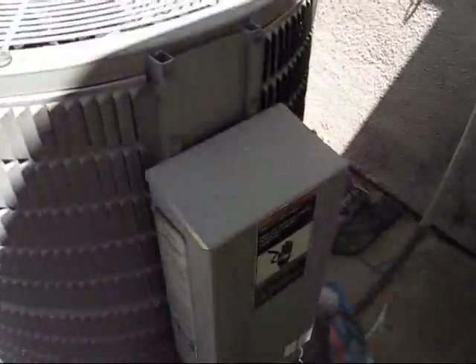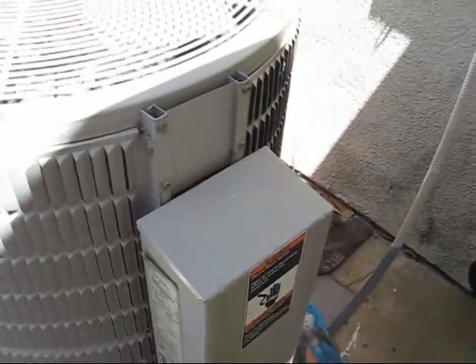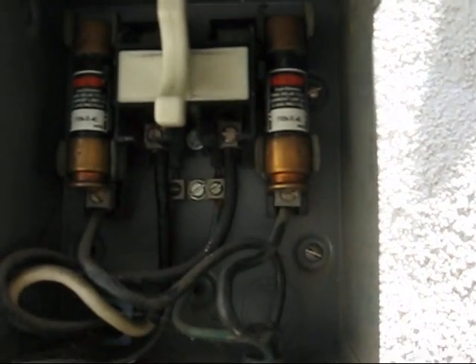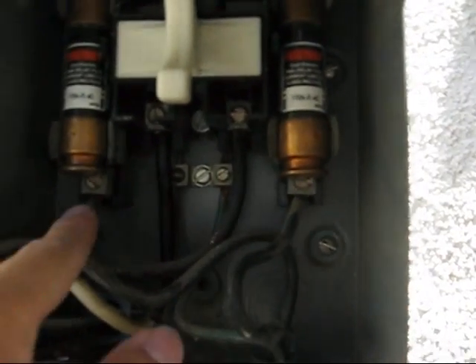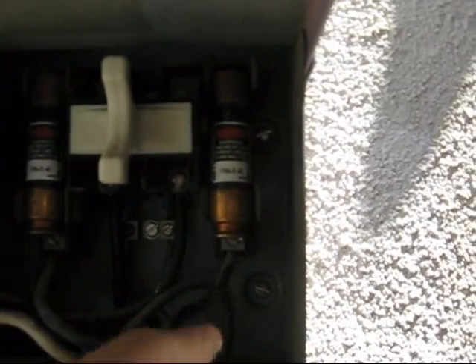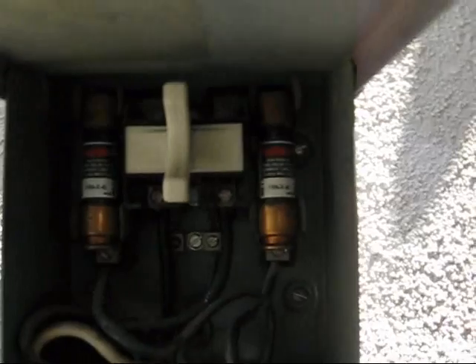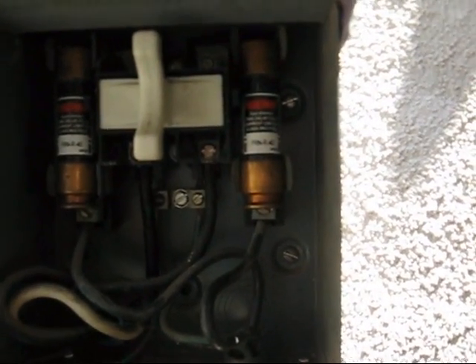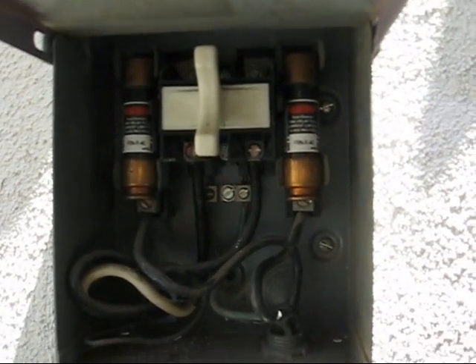So far this unit's worked pretty well. I had to replace the contactor once, and it's blown a couple of fuses. One thing I'd suggest: check those connections underneath the fuses to make sure they're not loose, because this one was loose. That caused the fuse holder to heat up and kept blowing the fuse — I went through three fuses before I figured out and corrected the problem. Also, that little plastic sheet that covers up the wiring is missing — it just crumbled when I removed it one day.